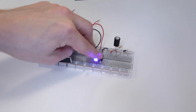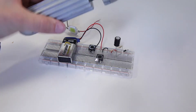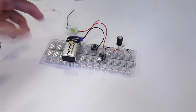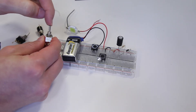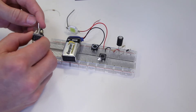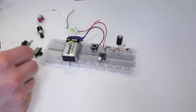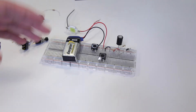You can change out literally everything in here with whatever you want — a smaller battery that fits nicer, and you can also scale down the CAD model. You can change out the switches. You can actually use two buttons, then you can also use the whole thing as a flashlight — that's impossible now since it will only flash. If you have a two-button system, you can hold both and have current directly from the battery. You can also use a toggle switch with three states: zero state in the middle that does nothing, one that charges the capacitor, and one that discharges it. Or a switch with only two states — one that constantly charges and one that discharges, in which case you'd remove the bleed resistor. The simplicity and convenience is what I've designed this circuit for.